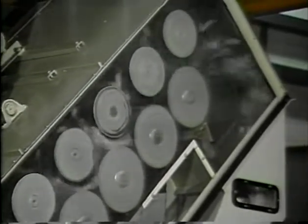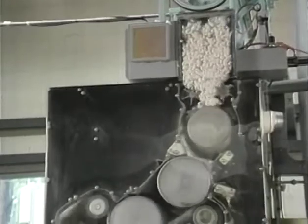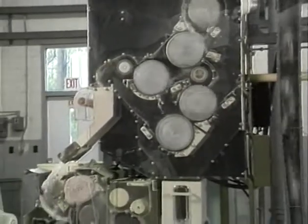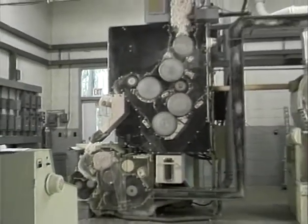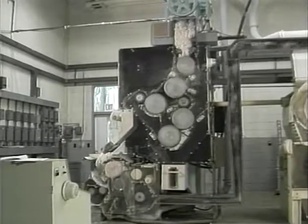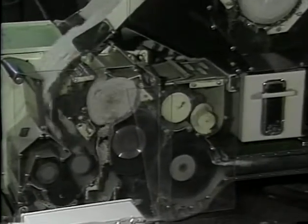From seed cotton cleaning, the cotton moves to the conveyor distributor, which carries cotton to the extractor feeder over each gin stand. Notice that the saw gin extractor feeder is designed similar to seed cotton cleaners. Designs vary, but most feeders include stick machine principles. They are effective cleaners because the cotton has been fully dried and opened when it gets to that point. But their main purpose is to meter a uniform flow of cotton across the width of the gin stand.